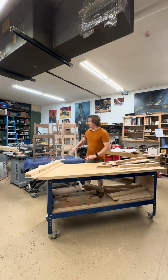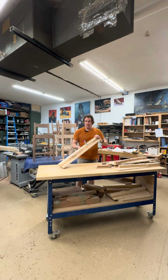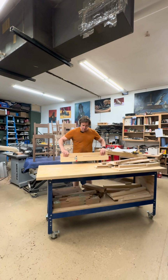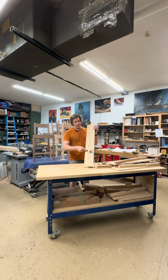So once I had the mortises put together, oh, here's another jig. Now that I have the horizontal mortise, this basically just acts like the fence. For everybody else who has the vertical one, this goes against the back of the machine. Instead of being upright, it just lays down. The reason I have this slot right here is that this is where the mortise happens.